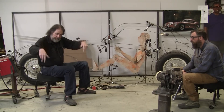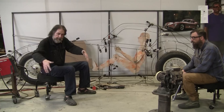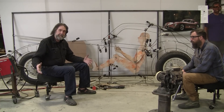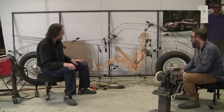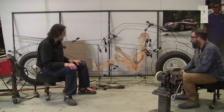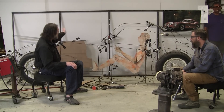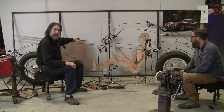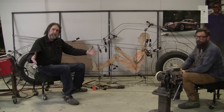A lot of cars, from the overhead view, taper in towards the front and taper in towards the back — they're fatter in the middle. That gives a little more passenger room in the cockpit. So we have that option because this will bend really easy. What I want to do is take this structure out and not make any connecting lines to the center, because that will limit our ability to figure out what width we're going to use.